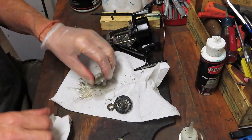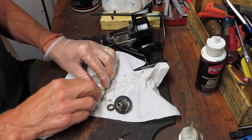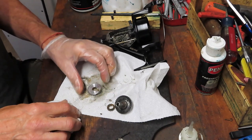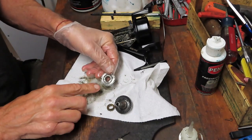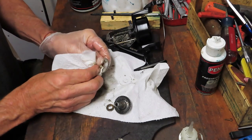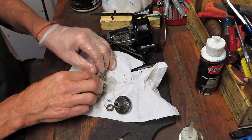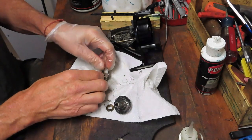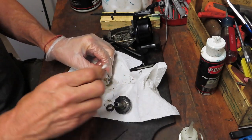Next, we'll clean the crosswind gear. I want to check a couple of things. These gears are nice and solid. Again, we have some dried grease on that gear, so that can always get in the way as well, kind of like a speed bump. We also have the dried grease on the back here. So I don't know if this is going to solve it, Chris, but it's going to go a long way to smoothing out the performance, because this stuff is pretty tight here, as most can see.